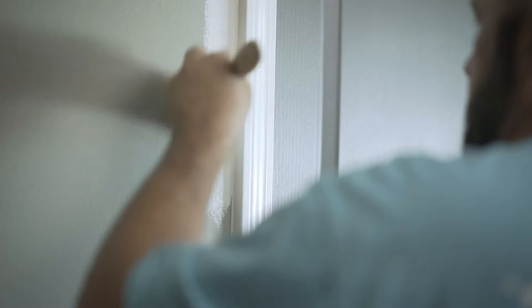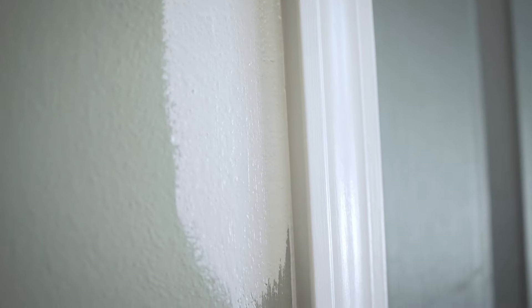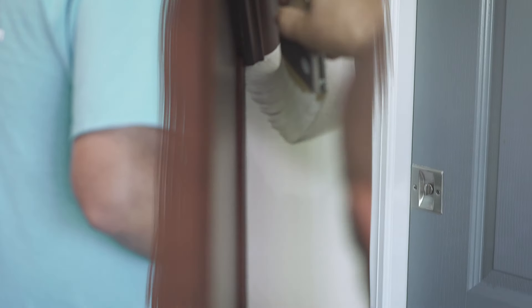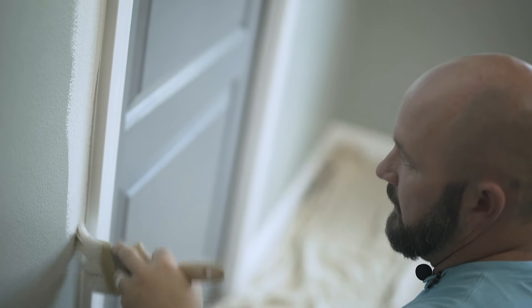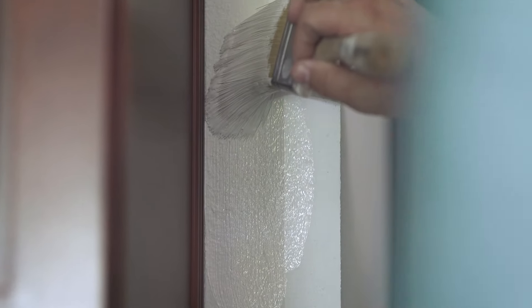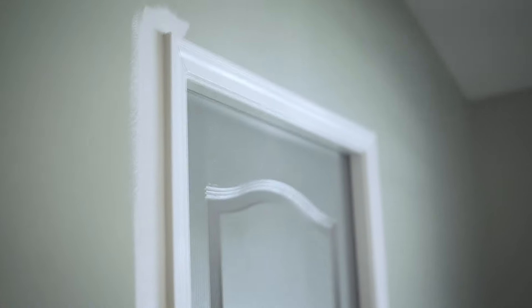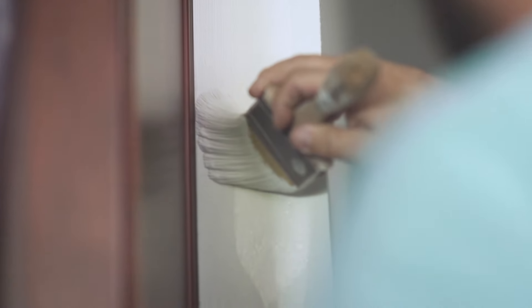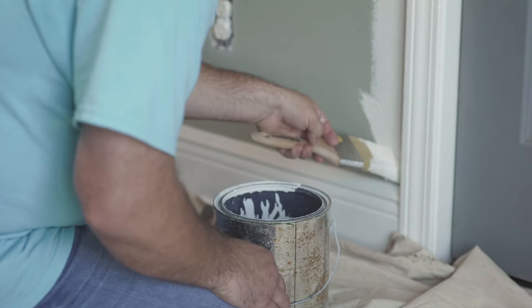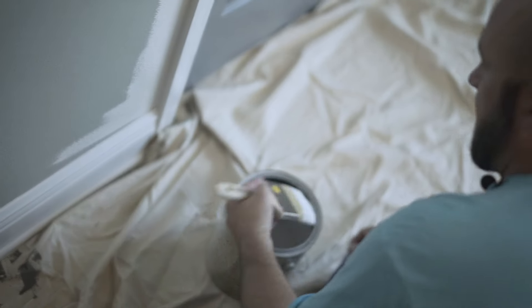I have noticed with this brush it doesn't take a lot of pressure to get in all of the cracks and nooks of the textured wall. Doing the textured walls, I personally would not use a soft bristle brush. Typically, we cut about two to three inches away from the frame for the guys that are going to be rolling, but I do like my guys to roll as tight to the trim as we can.